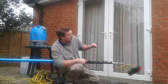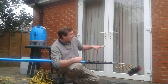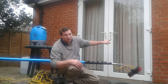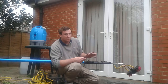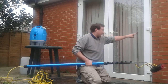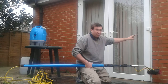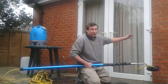You will get watermarks if you don't scrub the windows enough. When I do windows on a day like this — the weather isn't brilliant, it's quite dull — I would do these windows about eight times before moving on, eight passes on each pane. If it was really hot in the middle of summer, say August, I would be looking at doing these maybe 12 to 16 times before moving on. You need that water on there to make sure that when you leave the customer's premises, the spots that you can see where I've cleaned, when those spots dry, they don't become watermarks. These watermarks are caused by total dissolved solids which remain on the window — the total dissolved solids are essentially what the watermark is.